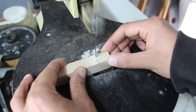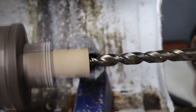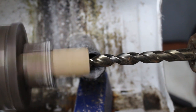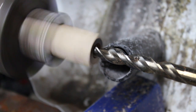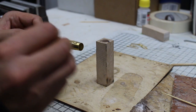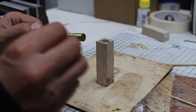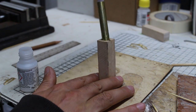To begin this whole process I started by cutting up a maple pen blank on my scroll saw and then mounted it on the lathe to drill out a nice big hole through the middle of the blank. For this pen kit I used a Sierra style pen kit which required a special drill bit. Then when the hole was drilled I took the brass tube from the pen kit, lathered it up in super glue and then just slotted that into the hole in the blank.